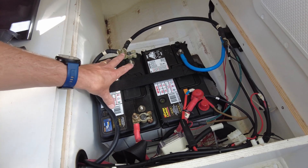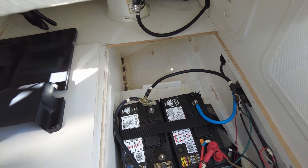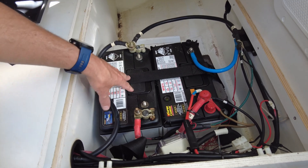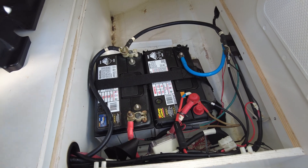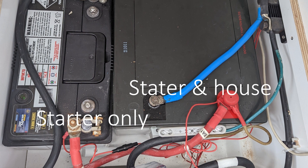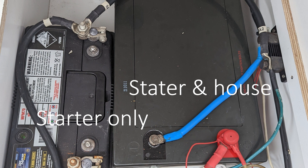There are the batteries — we've got two batteries and we have two motors. The way this is set up is the left battery starts the starboard side motor and the right battery starts the port side motor. The port side also is the house battery. Those two batteries are both starter batteries because I've started making the changeover. But in my previous setup, the port side battery is the house battery and supplies everything you need to stay aboard for a while, but it also starts the motor. And that's the bit that I've always had an issue with — your house batteries are starting a motor.